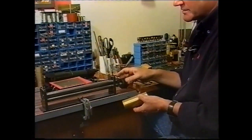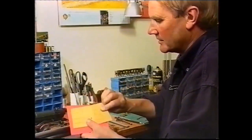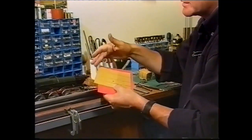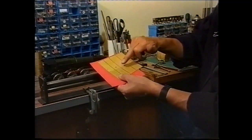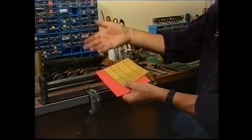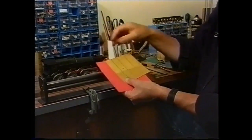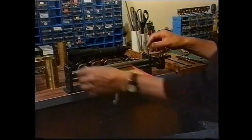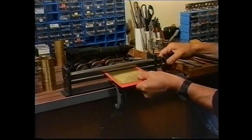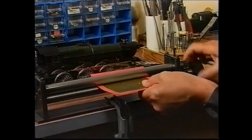What is worth doing is getting yourself a pair of decent rolling bars - these ones were made by Cherry Models some years ago, and there are a lot on the market now. Have a look around Guildex. I've already cut it out from the fret, using a pair of sharp craft scissors and filed up the edge to clean it up. I always put a piece of thin card underneath the material to be rolled, because any detail like rivets and boiler bands can be flattened through the bars like a rolling mill. So you use a bit of card the thickness of the detail you're protecting. Face down into the roller and wind it through, just feeling so it's lightly pinching the material.